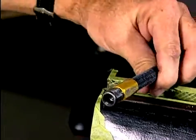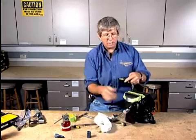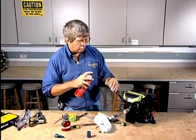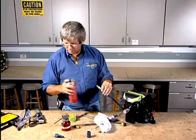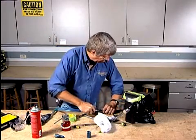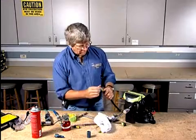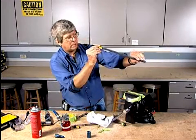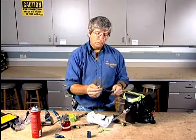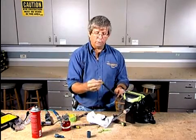We'll wipe that thing off. Next step: eyeball down the hose. We're going to want to clean that out — use a little bit of cleaner down the inside and an air hose to blow that out. Very important. Once we do that, we can sight down the inside of that hose to see if there's any foreign material in there. So we've got a new hose ready to install on our aircraft.